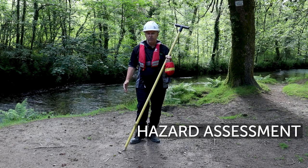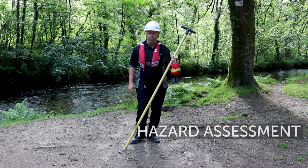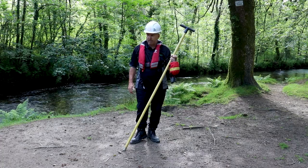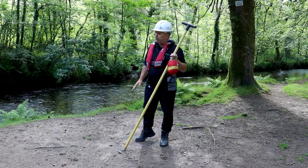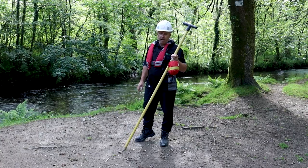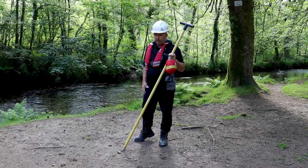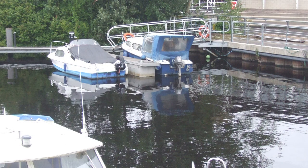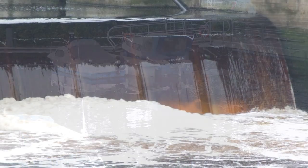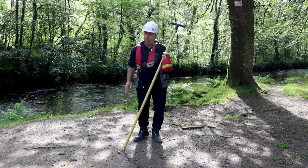When you conduct your last-minute risk assessment on site you need to have the appropriate PPE on, at the minimum requirement to assist you operating in those areas and provide some support if you need to climb out. You can then do a visual inspection of your work area to identify any real hazards. It's really important that you do a hazard assessment before you assess the risks. Hazards are anything on or around the work site that can hurt you — things in the water, the nature of the water, the bank, restrictions on access and egress, or other site users.